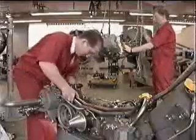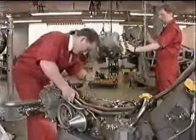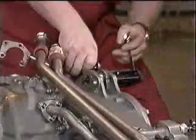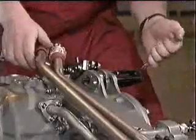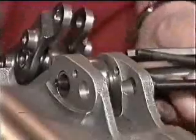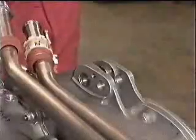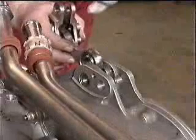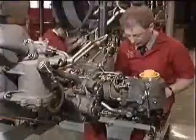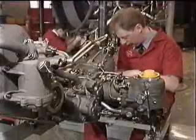If the gearbox module is to be replaced with another, then any necessary transfer of components can be done at this time. For instance, the gearbox mount brackets are part of the intermediate module and would need transferring to the replacement gearbox. Extractors are available to remove them. And then they can be refitted onto the replacement gearbox. And that completes the removal of the external gearbox.